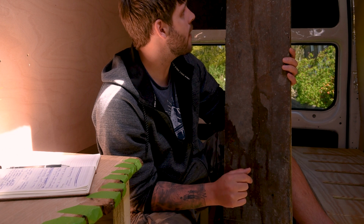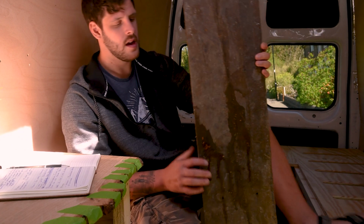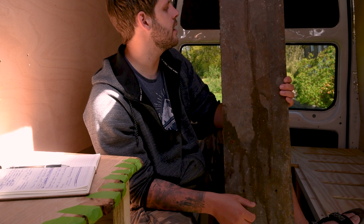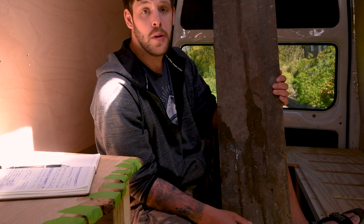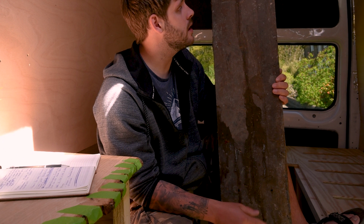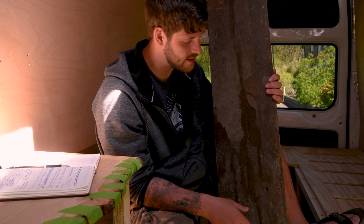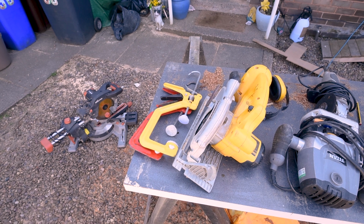However, the varnish or whatever it is that's been painted on it is vile. We need to turn it into usable timber. Now, this wood has actually been tongue and groove, so we've got these little slots cut into that side, and we're going to take that off because we don't need it, and all the edging is really manky. So we're going to plane that down. Then we need to cut them to size, and then we've got to sand them. If anybody's got a good, useful way of sanding these without getting out all the marks, but getting rid of the varnish.